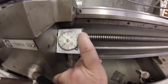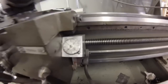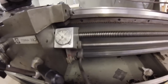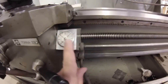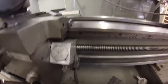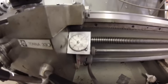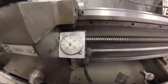I have a little magic marker line up here that I use because it's just easier for me to see. Now, if you're running an odd-numbered thread — an odd-pitched thread — you can use a numbered line only. If you're using an even-pitched thread, you can use any of them. But beware that the nut will engage on the half. So if you miss your line when you go for it, that's not going to be pretty. You're going to have what's called a half-thread, and you'll turn a 10-pitched thread into a 20-pitched thread, and it's going to look pretty ugly.